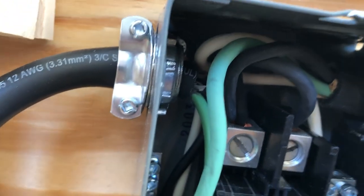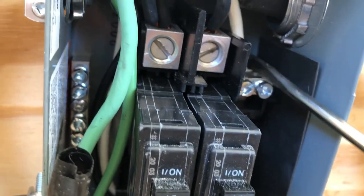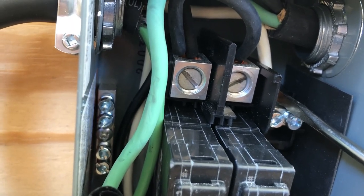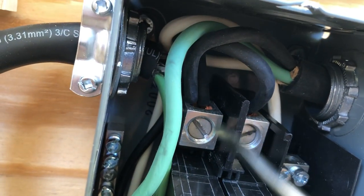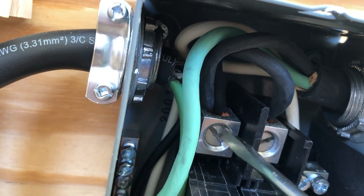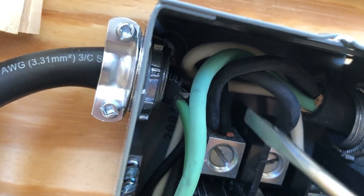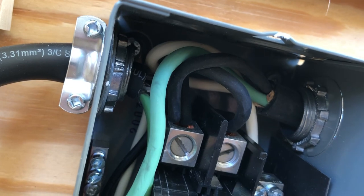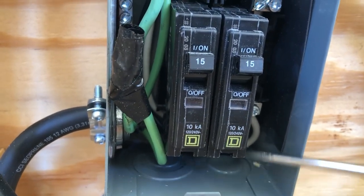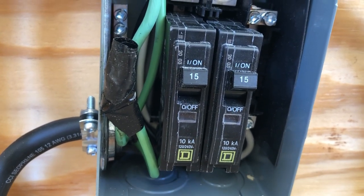As you can see, if you do this — let me try to get down here where you can see — your white is your neutral, and this thing ain't plugged in. Your white is your neutral right there, with your service coming in hooked there. Then your power would hook in, your black would hook in here. This doesn't have a bus bar, so I had to put a jumper across to make this breaker live. It's single pole, so your black wire connects to the back of both your breakers at the bottom.